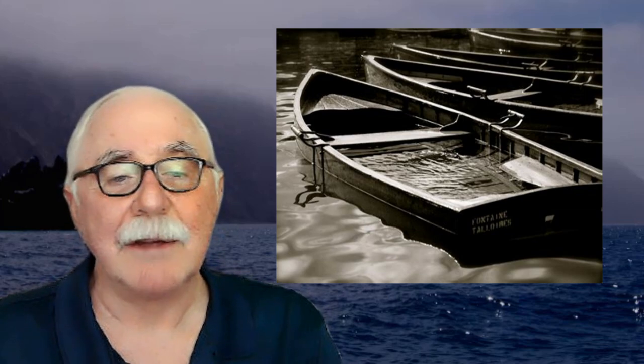Where rot comes from, even in boats in the ocean, is typically from rainwater. That's how water gets inside your boat. It doesn't come in through weeping through the seams, or even through hull fittings, or splash over the side — that's usually a minimal amount. And in one of my ply-on-frame boats that you've glassed, it's easily dried out after that.